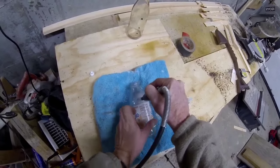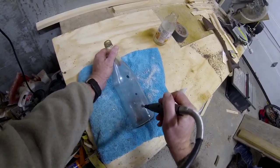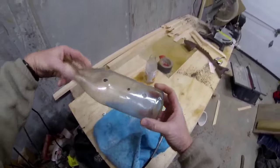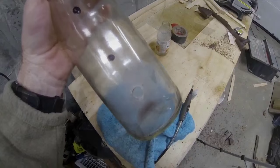You don't have to add a lot of force, but you do have to move the bit in a circular pattern. You can also see I drilled two holes very close together — it's not a problem. The only time you end up cracking the glass is if you don't add enough lubricant or cool it down adequately.